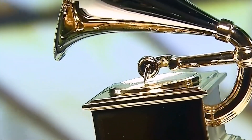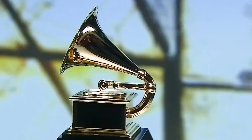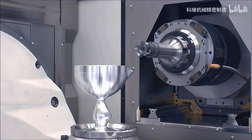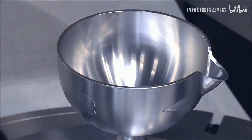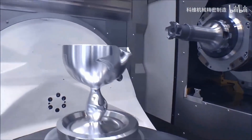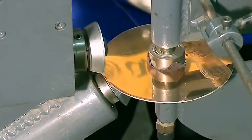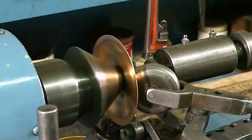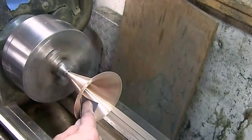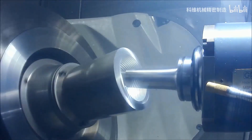Common main processes include metal spinning and metal casting. Metal spinning is usually cold working. There are several different metal spinning technologies, including CNC spinning, manual spinning, hydraulic-assisted spinning, and hot spinning. Metal spinning is a technology that forms flat metal plates — usually bronze or brass — into bowls, cups, round cup bases, and other elements. Metal spinning can also be mechanically assisted by a lathe.